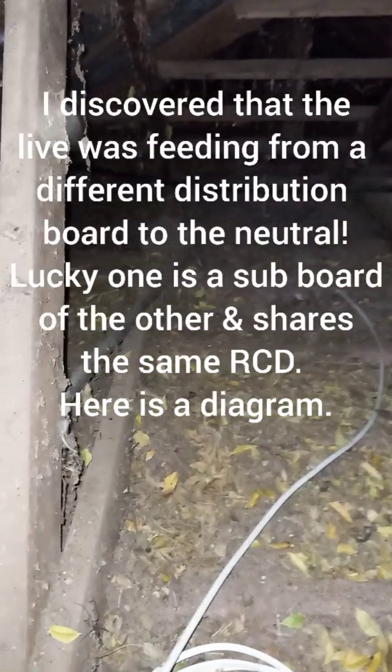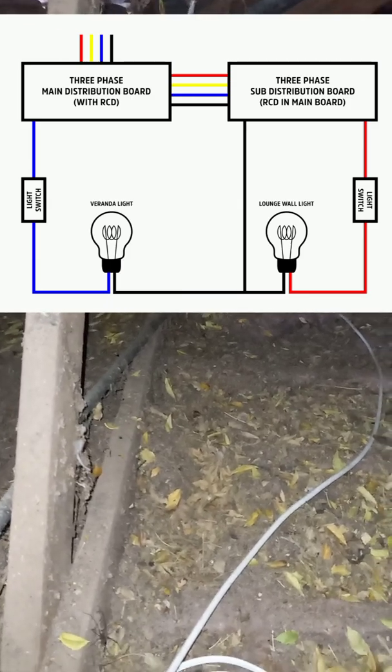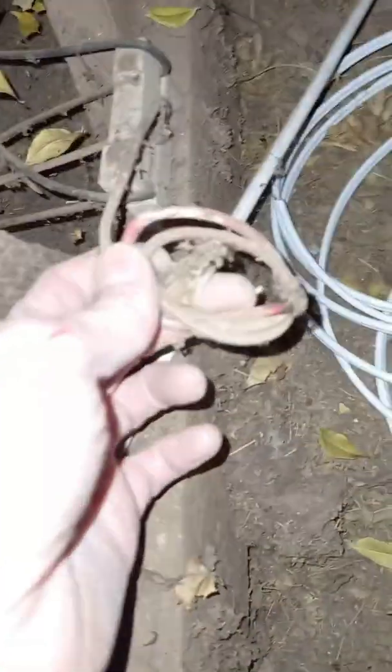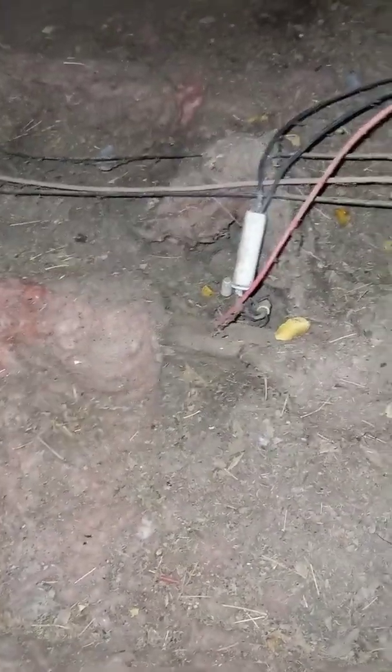This red here is coming through this conduit — that's the part that was rewired — heading off 180 degrees in the opposite direction to the next veranda light in the circuit. I've got my roll of twin-and-earth 1.5mm cable to use for the fix. You can see there's a disconnected red from the old circuit, and there are two of them because of that other fitting. All these are actually obsolete — I can pull that whole lot out.